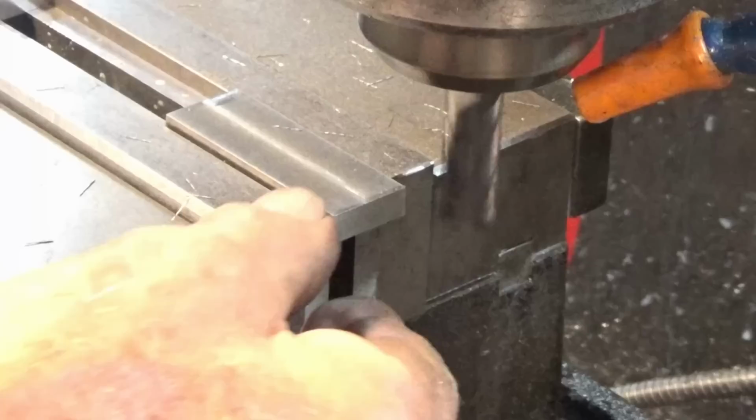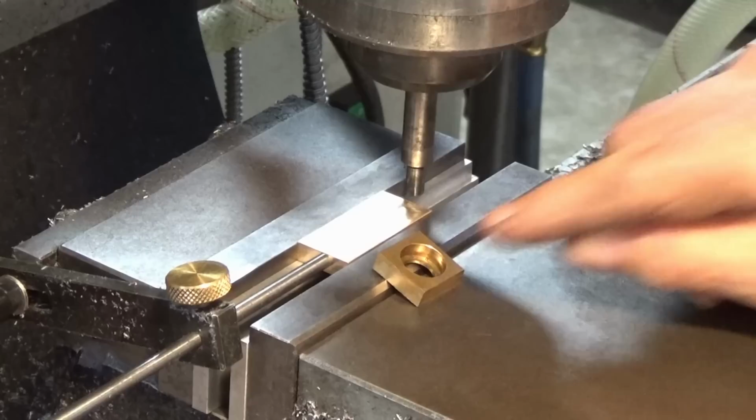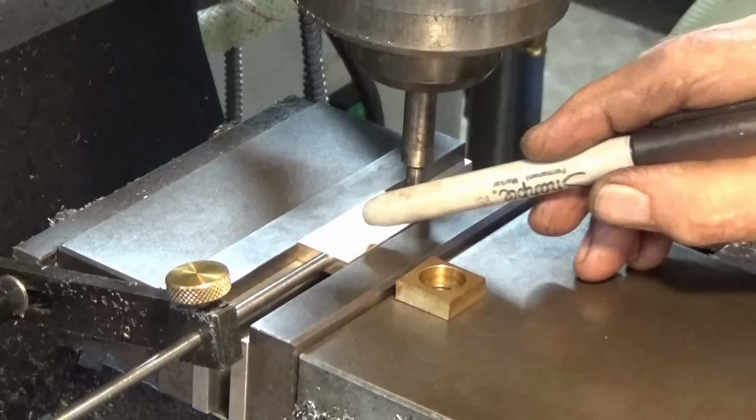I've got all my stock size now, and what I need to do is to drill and counterbore for those eccentric headed screws, so I end up with something like that. So this is sitting on a pair of sacrificial aluminium parallels, and I've got my end stop set up here, so I'm going to centerfind the part and offset from that machined end.